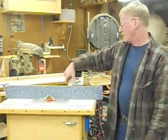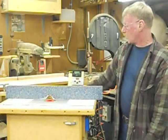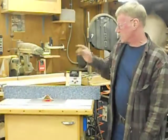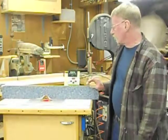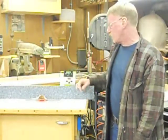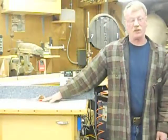So if I push my on button, now I'm going back down. You'll notice that on top of here it says minus three-eighths of an inch, meaning I'm three-eighths of an inch below the top of the table. If I hit the forward button, you can watch the router bit come up and watch the digital readout — the minus sign is gone, and now I'm seven-sixteenths above the top of the table. You might think that since I put a motor on this I've lost all my accuracy — well, you would be wrong. The thing about stepper motors is they can move very, very slow. I can move this at one-sixty-fourth of an inch at a time. I just moved it one-sixty-fourth of an inch up, and one-sixty-fourth of an inch down. I don't need to worry about setting the brake or the router going down. Because of my digital readout, it's going to stay exactly where it is, and I'm going to know that it stayed there.